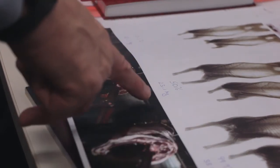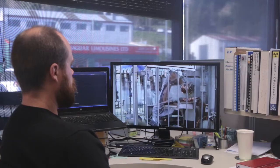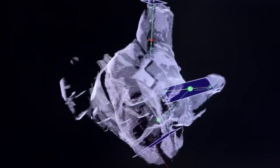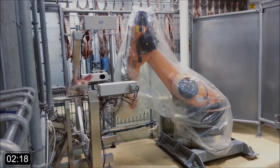The two different configurations of carcasses — strung and unstrung — have a different set of cuts required. So the vision system has to be able to cope with this, and it can detect which sort of carcass it's looking at and calculate all the necessary cuts. There's been a lot of work put into getting speed up — we can't afford to spend any time on the scanning because it takes most of that time just to cut the product. The grey points you see on the screen is the data that came from the camera, the green lines are where we found things like legs and necks, and the blue planes are where we direct the bandsaw to cut. So the vision system lets us customise cuts for each product, maximising the productivity and the yield for the customer.